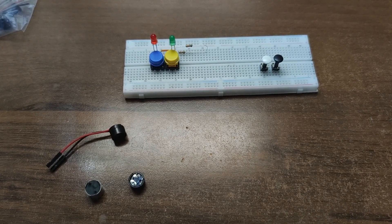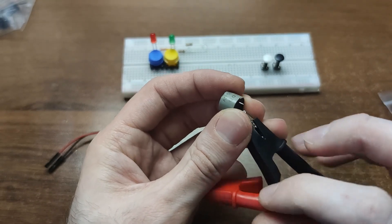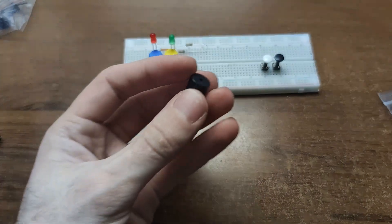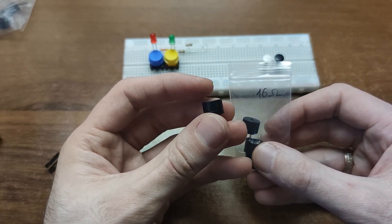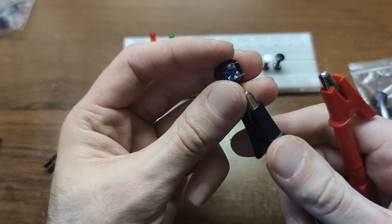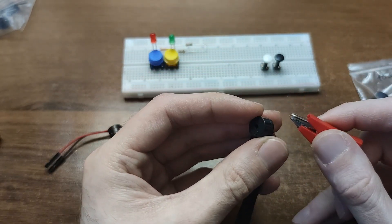Sound? You'll need a buzzer if you just want a beep – that simple. You supply DC voltage and it beeps. For more fancy audio stuff you may need a small speaker. As a beginner, prefer more resistance – 16 or 32 ohms is perfect if you want to actually play tones without frying your circuit. Less resistance means more current and more risk to fail.